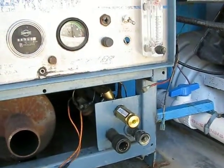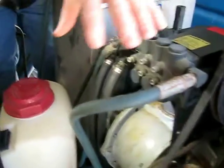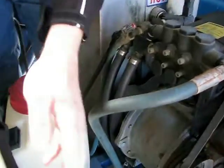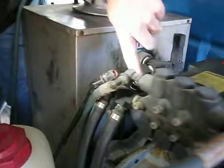Now when we start the truck mount it still doesn't build any pressure. The first thing I wanted to point out is the rule of suction feeding. There is no transfer pump feeding water to this pump — it's actually pulling it from this tank here.